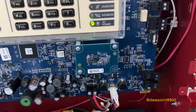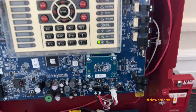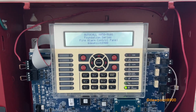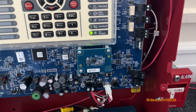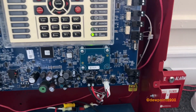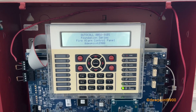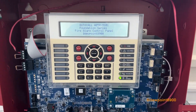Now this NFC reader — if you're using the mobile app, this is how you download the new job to the panel. Once you're done adding your devices and setting options, you go into the keypad, open up the NFC option. This will turn on and then you just hold your phone right next to the NFC reader. It downloads the job straight to the panel, which is pretty cool. I don't think any other panel has really done this before, and from my testing it seems to work pretty well. Of course, this depends on the type of smartphone you have — you need one with an actual NFC reader.